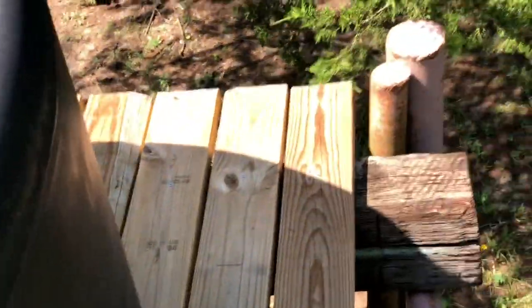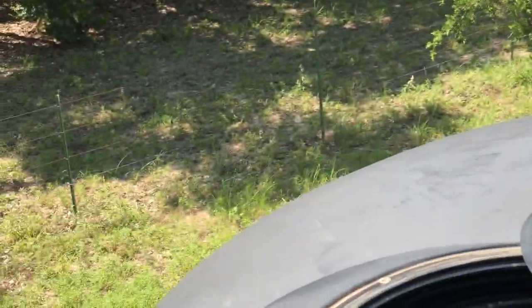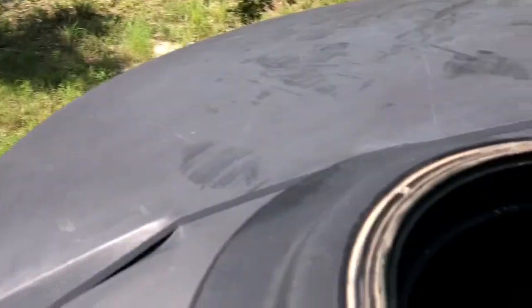This tower itself was fabricated from some old materials we had left around. These are pipe H-frames that would normally be buried in the ground. We banded them together and lashed them, put some railroad ties, and then planked it with 2x6s, then placed our poly tank up here. So 550 gallons — to the top of the water level we're about 10 to 12 feet above ground level. That gives us our pressure — about 5 psi to the spigots out there based on the elevation.